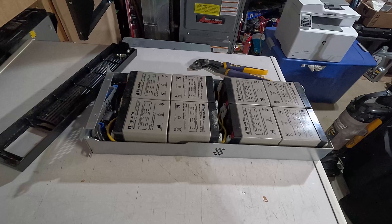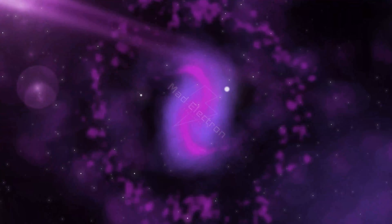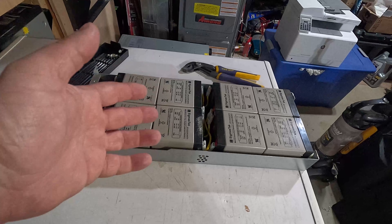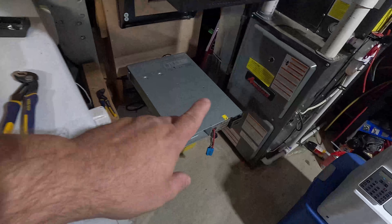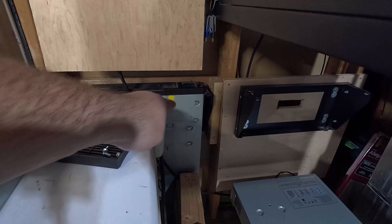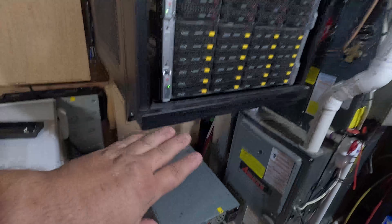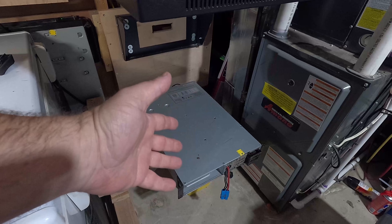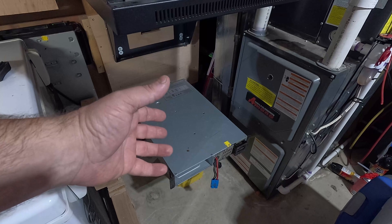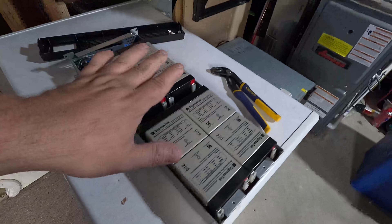I think it's dead. Hey everyone, how's it going? So yeah, this is a battery pack for one of my UPSs. It's sitting down there right now because normally it's mounted vertically just like this one is right here. This one's for my deep freeze, this one runs all my server stuff. I have these set to do an auto test for the battery capacity every two weeks. The last few times it doesn't tell me the battery is bad, it just shuts off and then turns right back on, which means these batteries are absolutely shot.